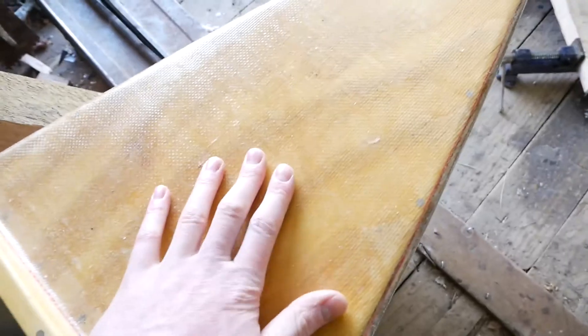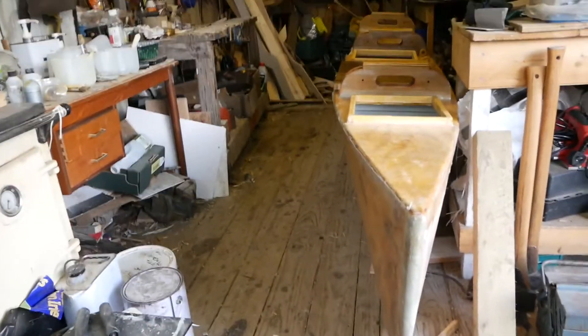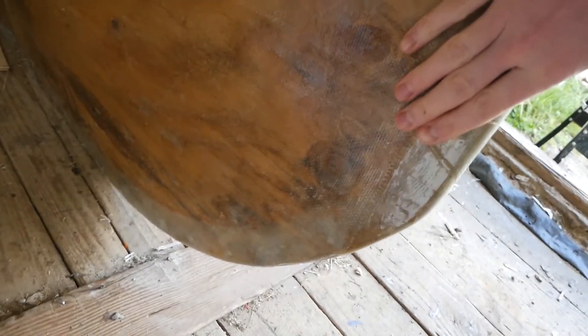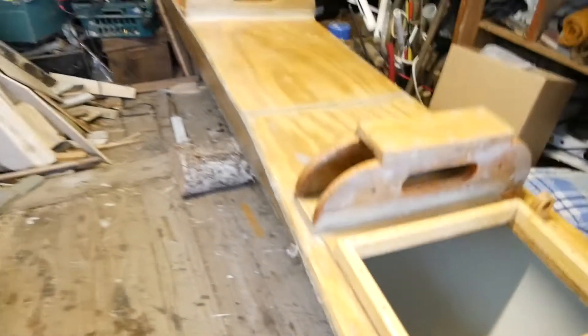Going forward there are more glassed areas on the bow. If you imagine the beam is going to be here, the deck is going to come all the way to here with this area around the front — it's going to look really nice with just the hulls pointing out. Looking at the front, the hull is really really thin and sharp — that deep V is just going to slice through the waves. The keel has been reinforced with two layers of fiberglass. The hulls actually have a wooden keel added on, which has also been fiberglass-strengthened, so it's all really really strong.